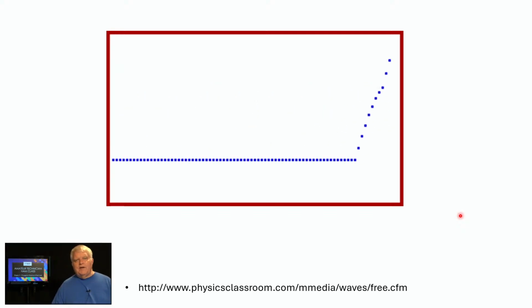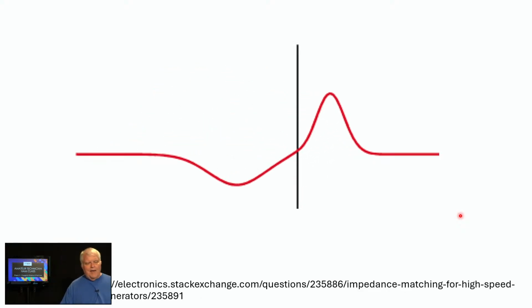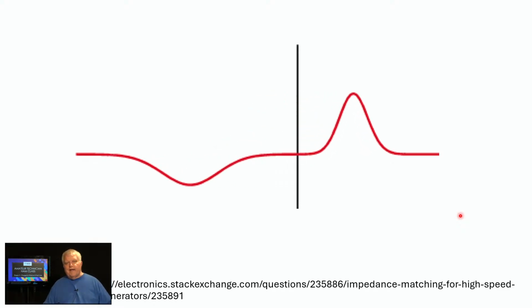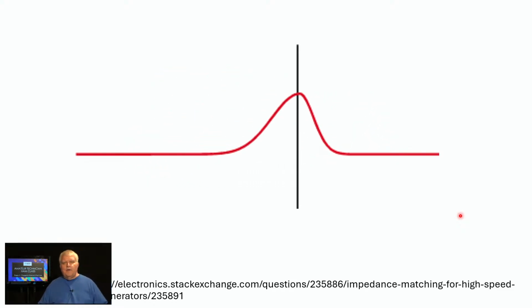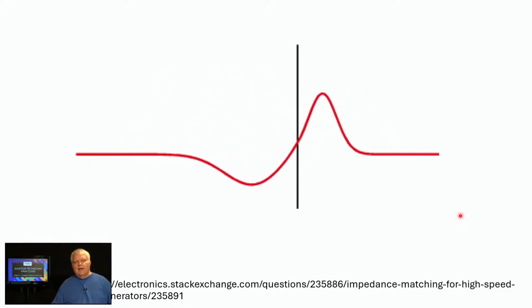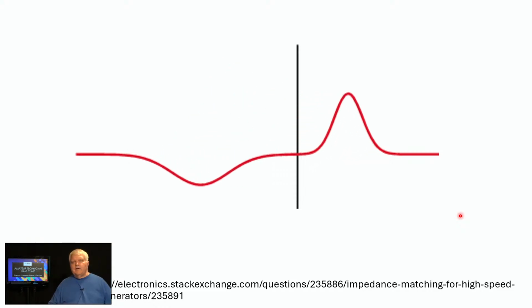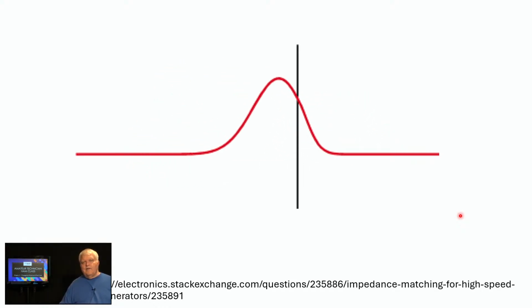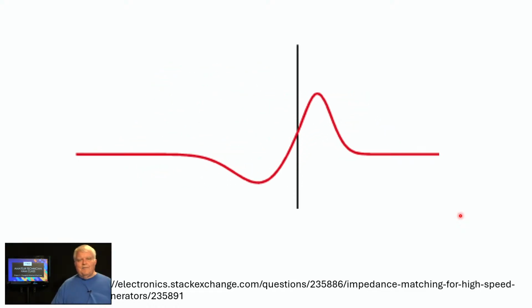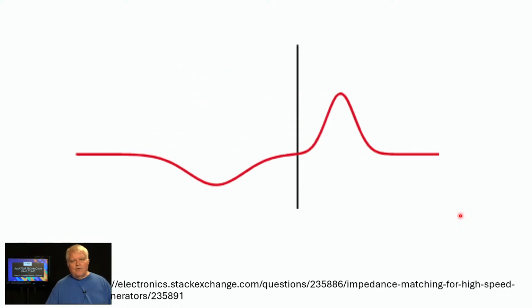All of the power that is being transmitted is coming back. Now, that's not likely what's going to happen. More likely, something like this is going to happen, which is a partial reflection of energy. So you see the big pulse of energy going from the transmitter on the left to the load on the right, and much of the energy, about half of it, let's say, is being absorbed by the antenna, the load in this case, but about half of the energy, maybe a little less, is being reflected back. That's a typical operating scenario in an amateur radio station.